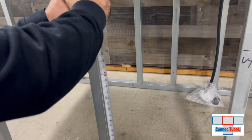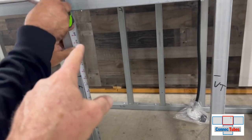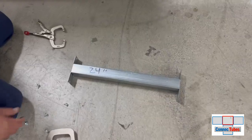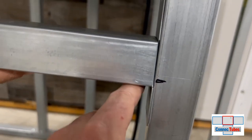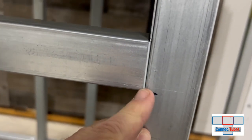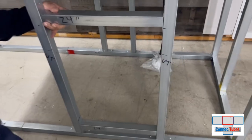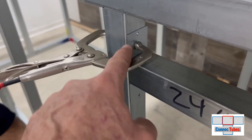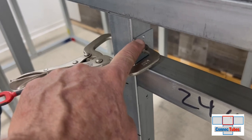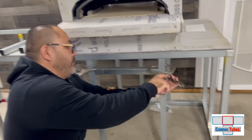We'll install the other tube we cut to fit, with 24 and a half inches of clearance for our example. We'll take the top tube with one-way couplers already inserted and position it so the bottom of the tube is just at or slightly above the marked line, giving us the full 24 and a half inches of clearance. We use clamps to hold it in place — the one-way couplers have a great spot for clamping. We clamp both sides and then lock it in with screws.